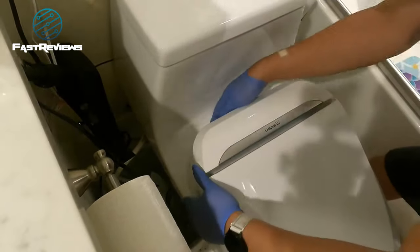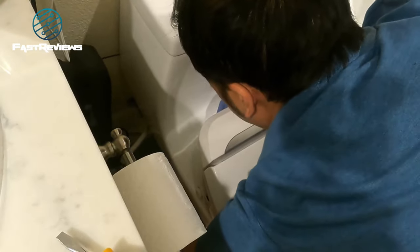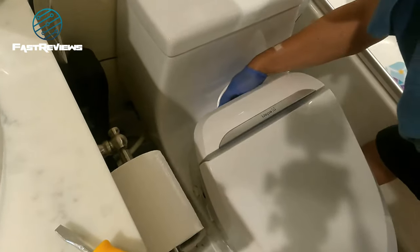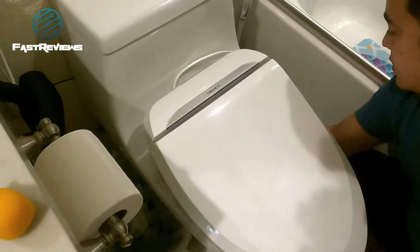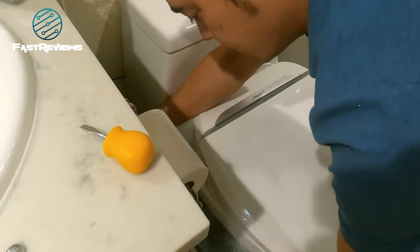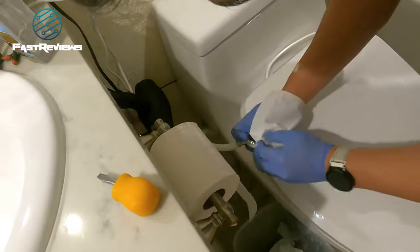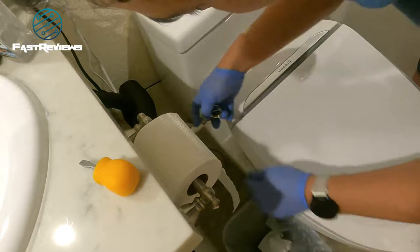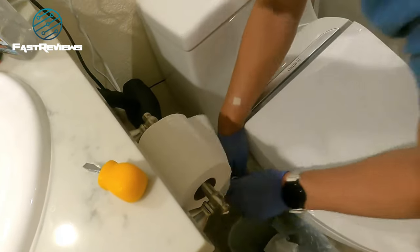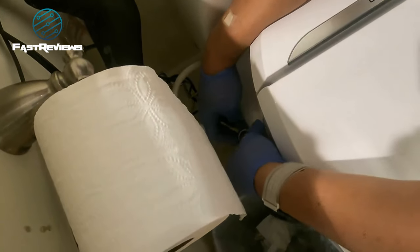If you're having problems sliding it in, you can paint the bottom a little to provide resistance. Make this flush with the toilet. We are now screwing it in. Don't forget the water line — we're going to screw this in and check for debris on the rubber stopper. Make sure it looks good before screwing into the supply.